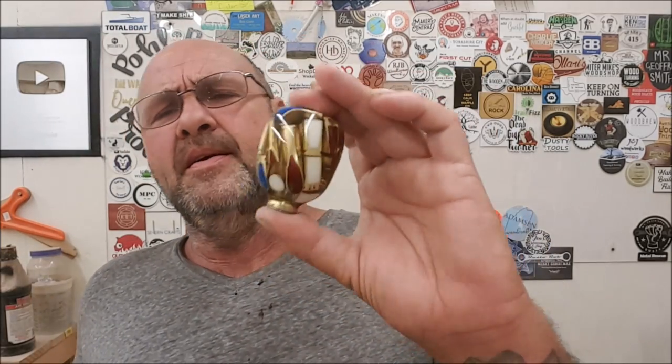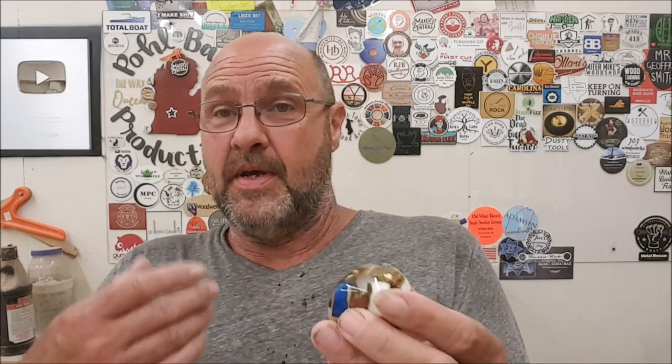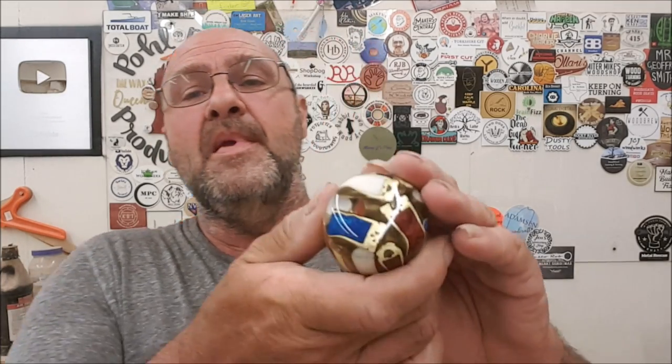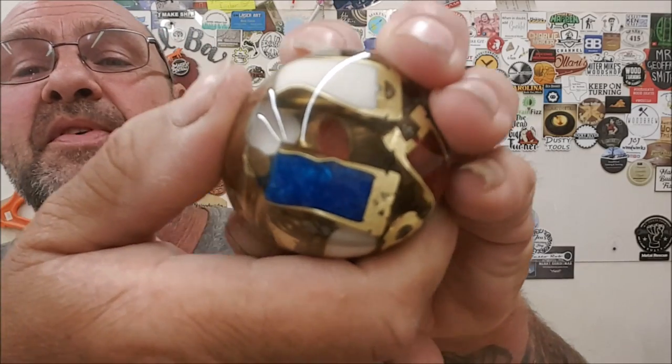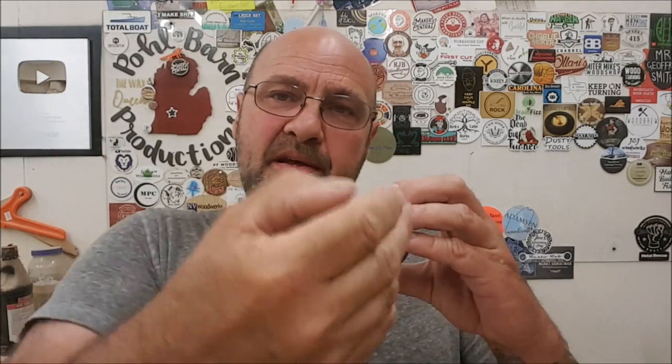It wasn't quite what I expected. It was not as hard as the other one. So the annealing process did help. I still had to use carbide. And as you can tell, if you see this blue one right here, it's bent. That's because the banging bent it, and it got hot and kind of warmed up the resin and moved it over. So sharp carbide is probably a good idea. Not that I couldn't turn it with traditional tools, I did do it. The carbide did help better.